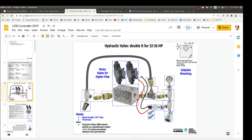And that pressure switch, where's that? I think ignore those red wires. The pressure switch, once activated, what happens? No, the pressure switch is just a signal. You're just saying, do I have high pressure or not? I don't know what those wires were. The red and black, that's power to the switch. But the way it works is you're either sending on or off to the microcontroller.